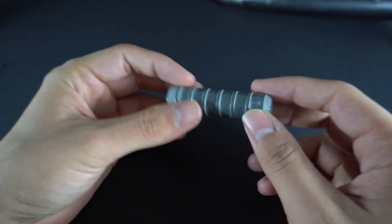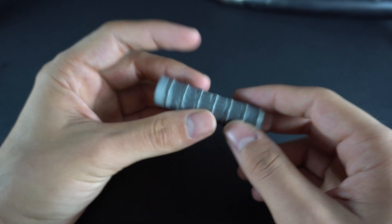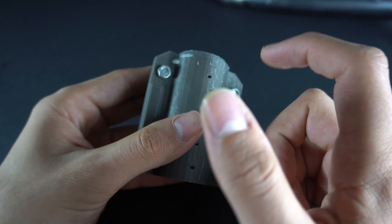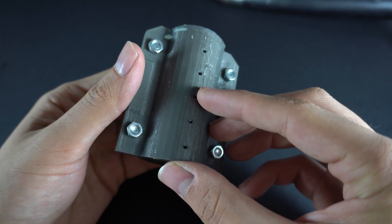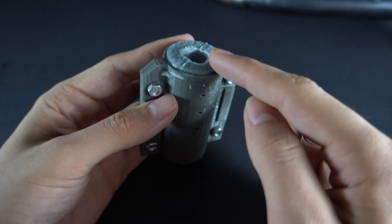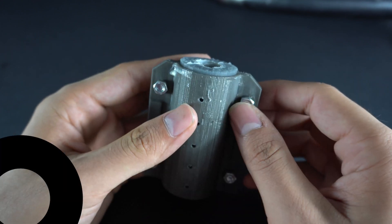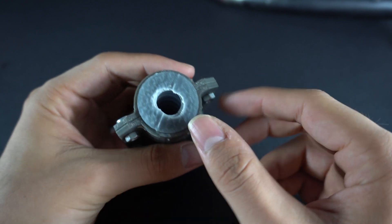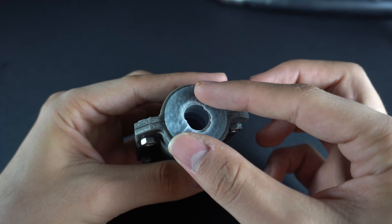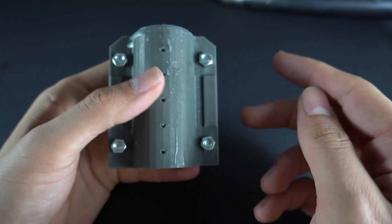Now piece C, which is the actual resin part. I came up with two methods for achieving these effects. The first method — the simplest but most time-consuming — is casting epoxy resin with different pigmentations in a mold. I modeled a mother mold: two pieces with a silicone mold, little holes and keys to hold them together, and exits to know your silicone level. You need tin silicone which doesn't react with epoxy. You then cut a slit to demold the piece and sand and polish it.